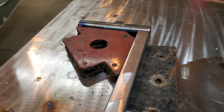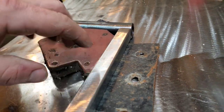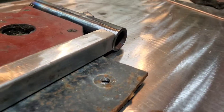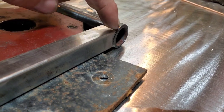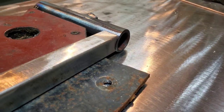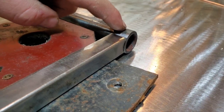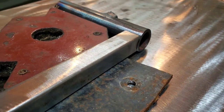With a little help from a magnet and an offset piece, we're close to the center of our pipe. I did a little cope with our flap disc there. Now this is thin wall, and this is almost 3/16 thick.